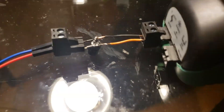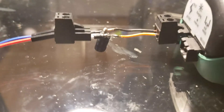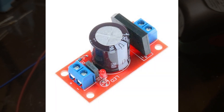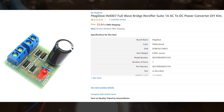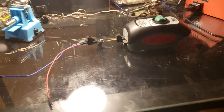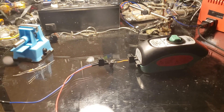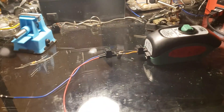I have the feeling this will remedy the issue with the Ecobees. However, the vendor probably isn't going to do anything like this in the field. Maybe there's something pre-made you could buy — just two wires in and two wires out — for a rectifier and a capacitor. It would be way simpler than putting in another transformer and relay to run its own 24 volts to this thing, but that's what they're talking about doing. Me being a geek, this is what I would do.